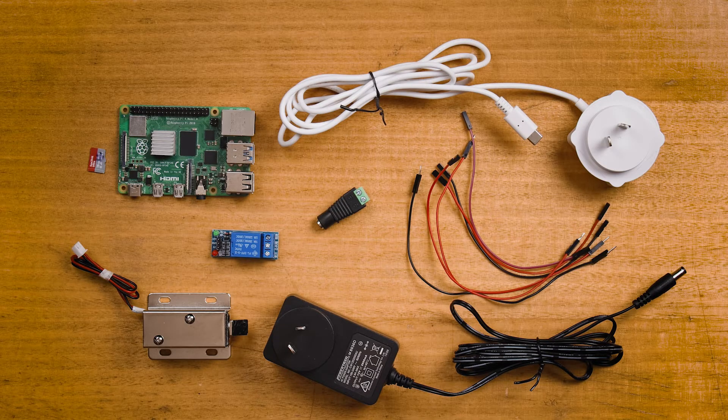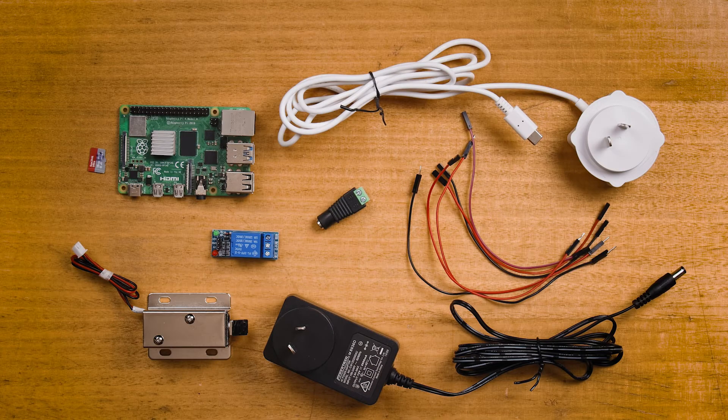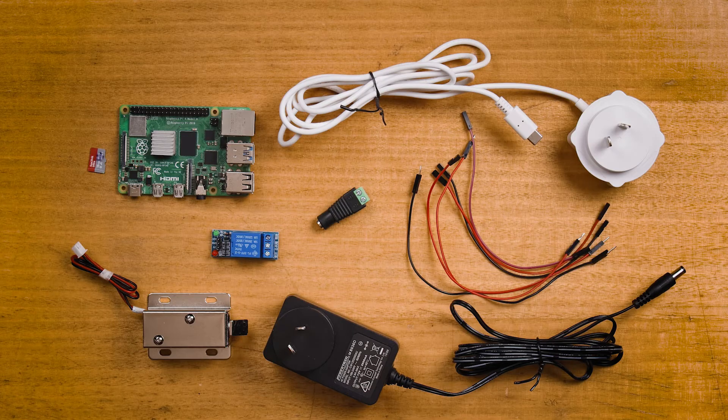I'm using a Raspberry Pi 4 1 gigabyte, but this will definitely work with earlier models. You'll also need a power supply for the Raspberry Pi — I'm using the official Raspberry Pi power supply at 5 volts — and a 12-volt 2-amp power supply for the solenoid. Solenoids of 12 volts usually need around 600 milliamps to drive them, so if you're using multiple solenoids simultaneously you may need a higher current from your supply. You'll also need jumper cables, both female-to-female and male-to-male, and a DC power jack to separate the ground from the positive easily.